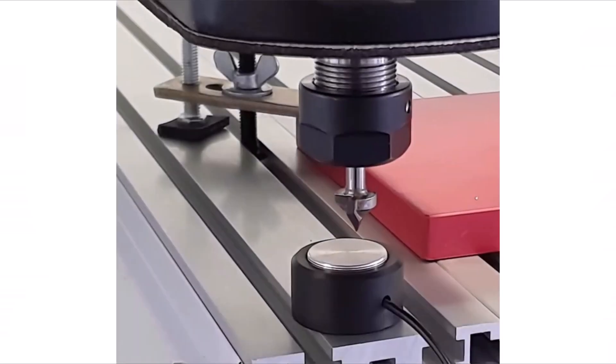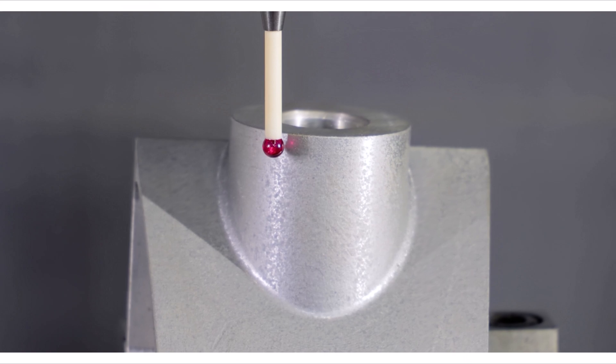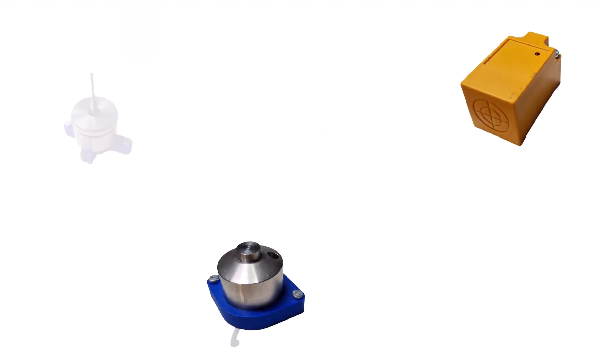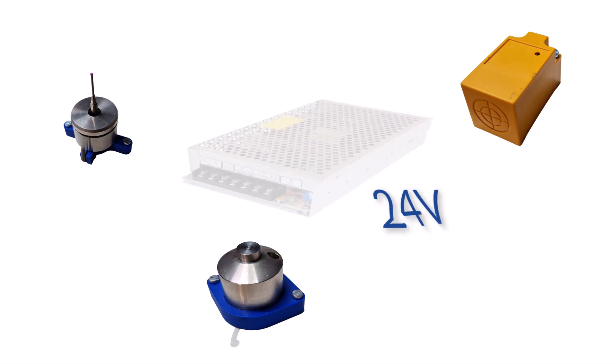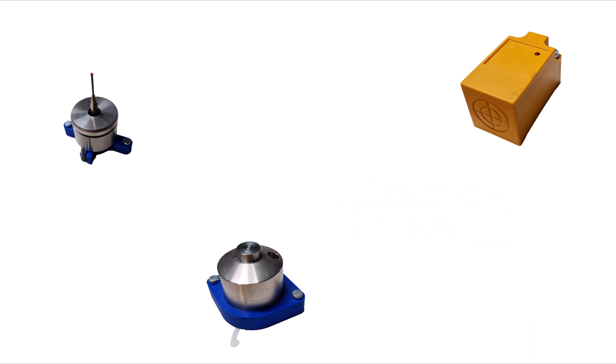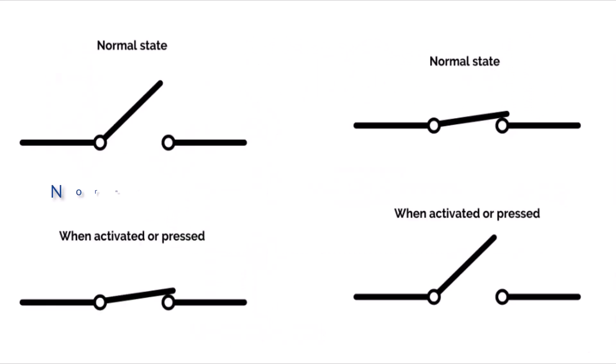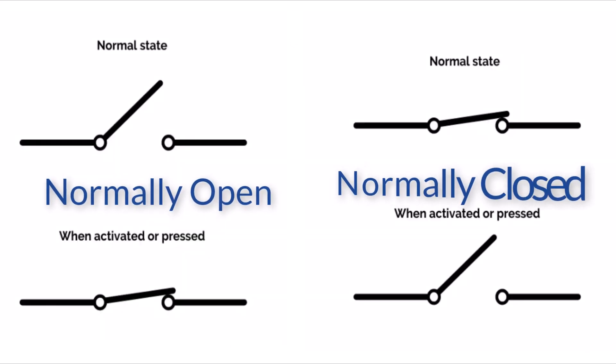The sensor hub allows you to conveniently mix and match sensors for applications like measuring tool length or finding a position. These sensors come in a variety of flavors. We only use 24V powered sensors. Two main characteristics that you often only consider later when it is too late are whether the sensor is an NPN or PNP type, and whether it is a normally open or normally closed version.